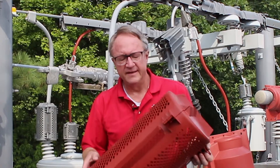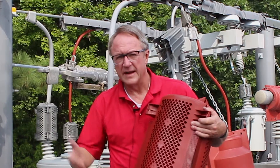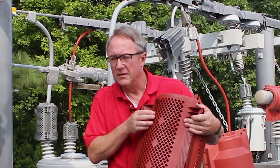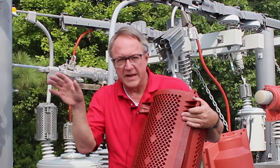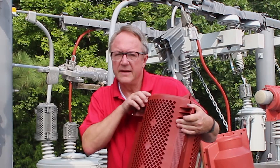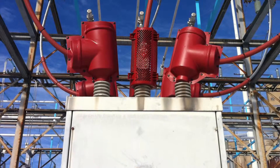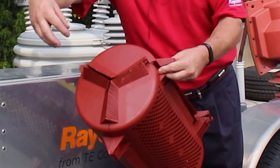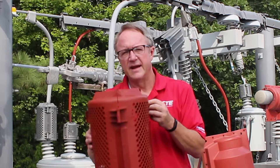There are several features that we put into the design of this inspection cover that we think makes it a superior product on the market. First off, we made sure that our overall cage pattern goes all the way from the bottom all the way to the top — not only for viewing angles when you're trying to inspect the bushing and the connector inside, but also to limit the amount of bug ingress at the top. With the three-piece design we wind up with more cable exit coming out of the sides, plenty of cable exit out of the top, and plenty of water wash to make sure we don't have any bugs living inside the cover.